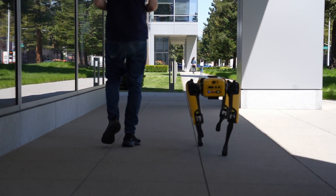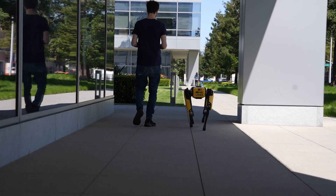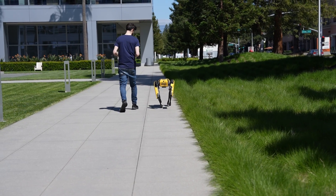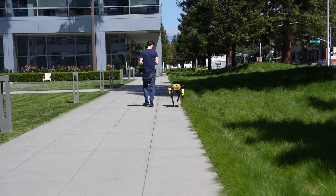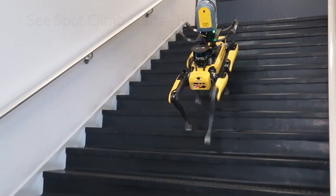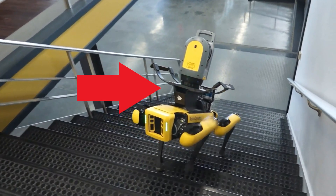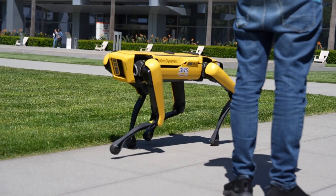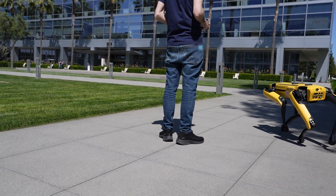Spot is great for use in remote environments. You can remote control it and move it around, or program it to behave autonomously. Having four legs means it's very stable, able to move in difficult terrain and able to climb up and down stairs very well. We've also seen how it reacts to forces to keep a stable footing. It has space on top for attaching payloads — examples are extra sensors like lidar or more cameras, or actuators like a robot arm. Those increase Spot's ability to perceive and measure its environment and interact with it, meaning you can do things like monitor very remote environments or places that are dangerous to humans, like nuclear reactors.